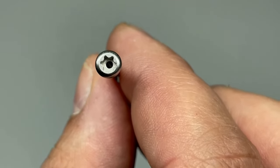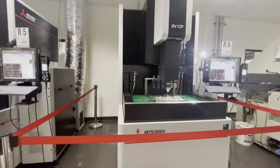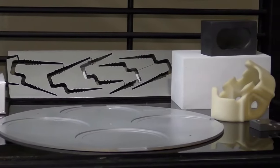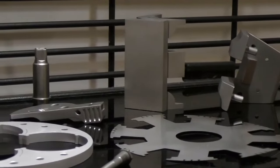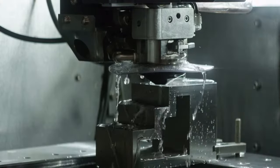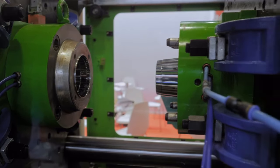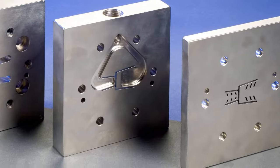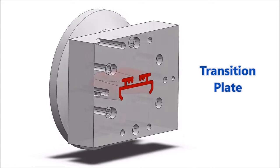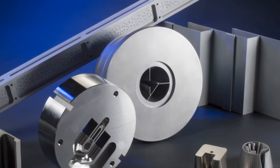The consistency of size as well as the burr-free result makes the process the best choice. For decades, wire and sinker EDM have been used for tooling production, from plastic injection molds to plastic extrusion tools to stamping dies. EDM is a required process. Mold cores and cavities are readily produced with custom machine electrodes and sinker EDM. Profile plastic extrusions are manufactured with extrusion dies, transition plates, and vacuum sizers — these components are designed and built with wire EDM in mind.